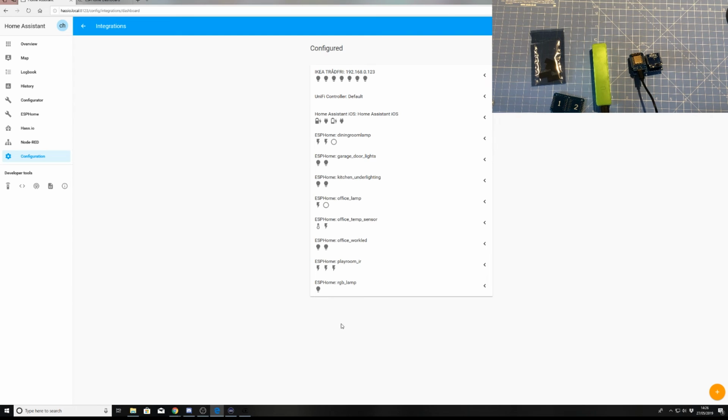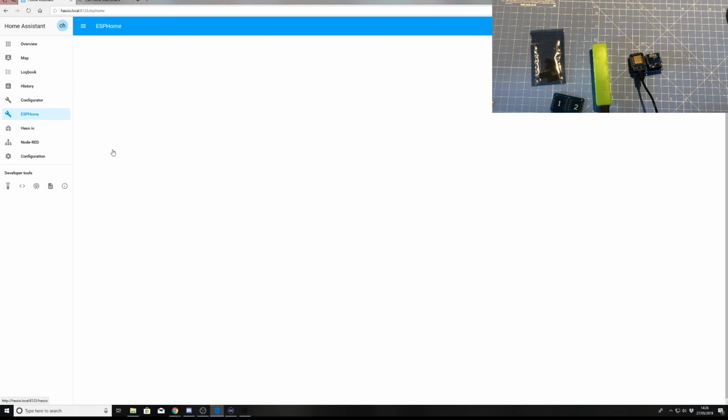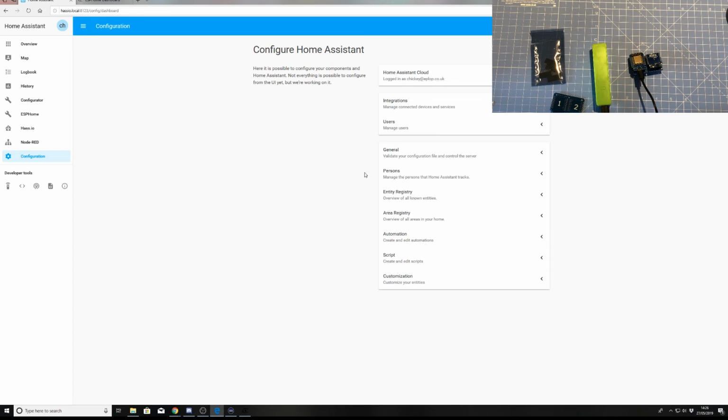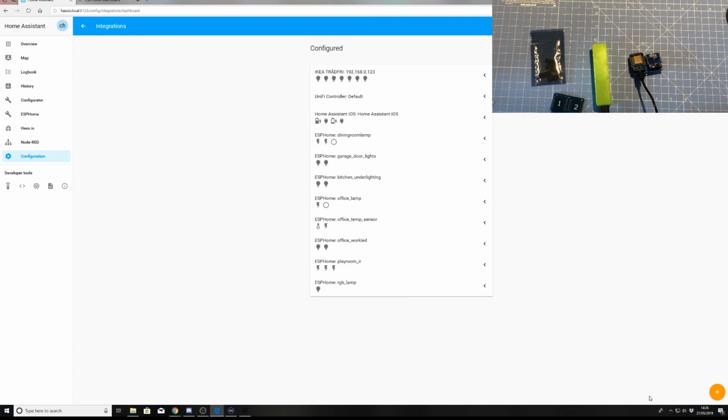The reason you have that problem is with mDNS not being propagated through subnets. I actually am doing that, so it means that in ESP Home, I can say if devices are online, which if you haven't got mDNS in place, it won't, but it doesn't do the auto integrations. You can change it instead of mDNS to use ping, so that's maybe something I might look at, but for now, just having to click add on the integrations is not the end of the world.